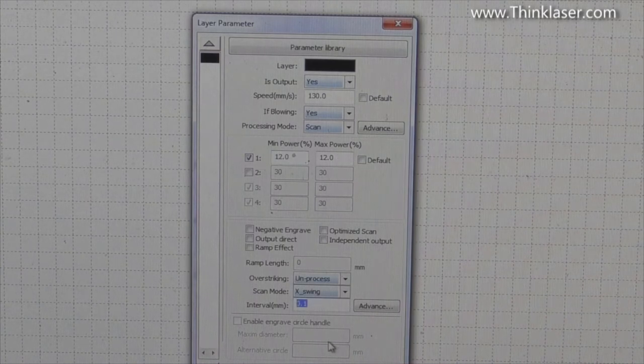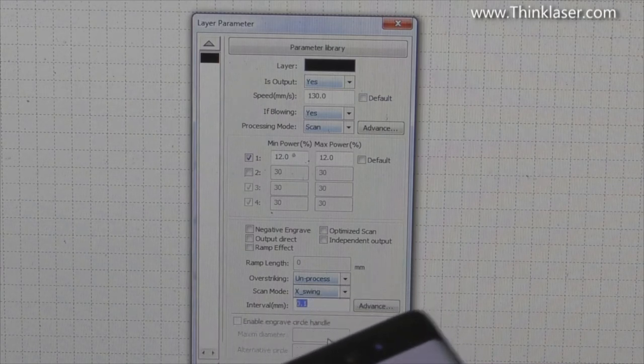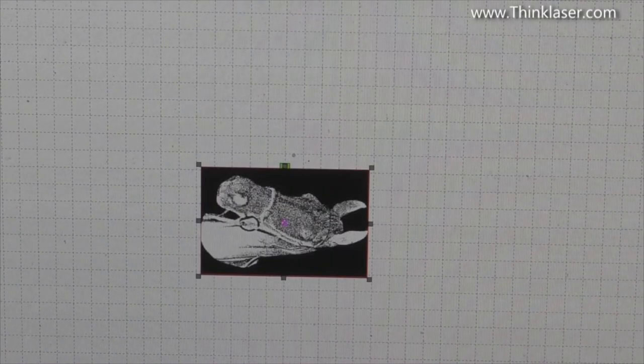Pitch. Now that's an interesting point. Because we're doing a dot graphic, we really ought to make the pitch match the graphic. So 25.4 divided by 160 pixels per inch equals 0.1587. Okay, and I think we're ready to go.